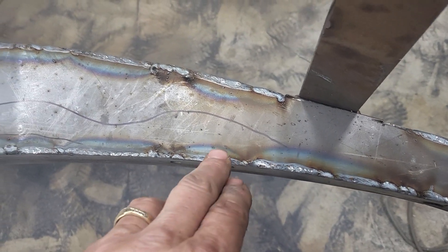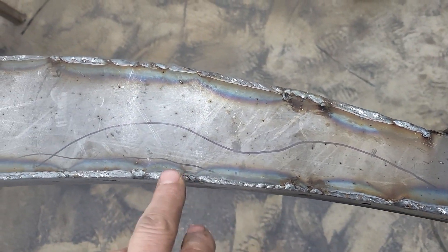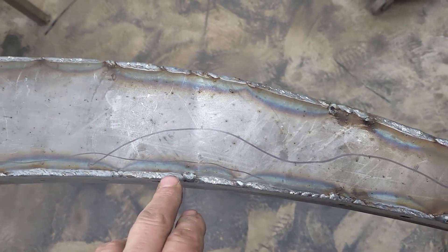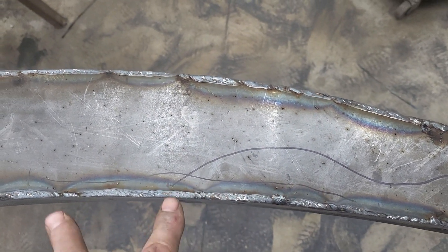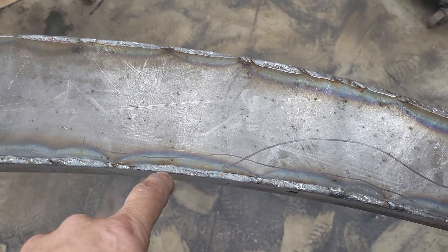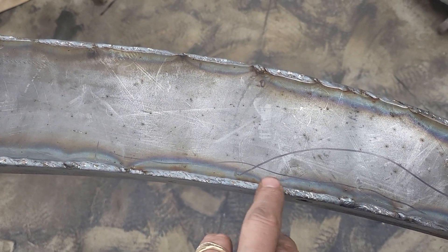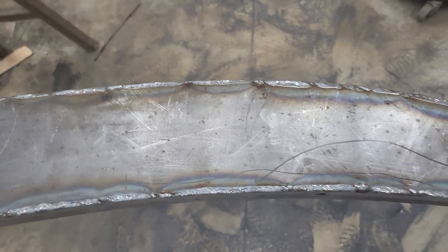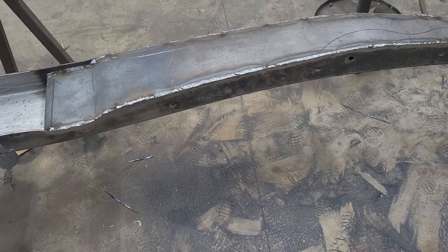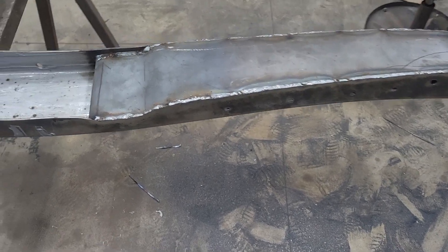You can see in the heat signature I welded from here to here and here to here and so on. You'd get up into the little stitches or tacks that I was making, but I would cut — if this section needed to be taken care of — I'd take my cutoff wheel and cut across there to give me that gap and then come in and weld it up, and it worked out very, very nice.